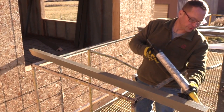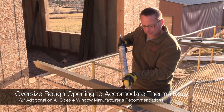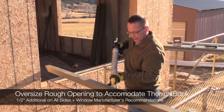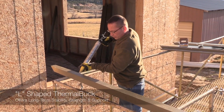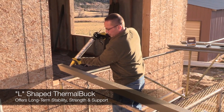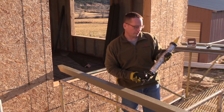The reason for the shape of the Thermal Buck: there's a leg that goes inside the opening, so we have to make the rough openings larger than what we typically do. That's for strength and installation reasons. The fin that goes inside the opening keeps the Thermal Buck tight up against the wall. If you just had something on the outside, the weight of the window could very easily pull that away and cause a lot of issues.